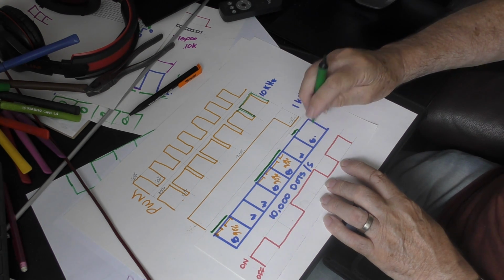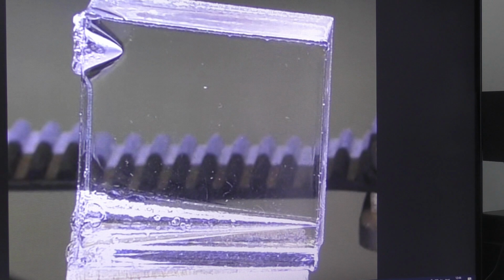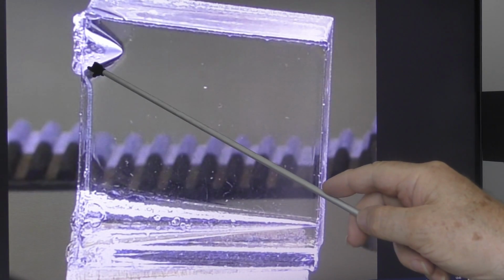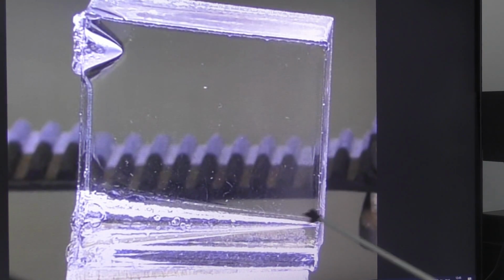Perhaps I ought to explain that, because there's another rather strange peculiarity about an RF laser. Now this is a picture of a glass tube mode burn. Here we've got full power for 10 seconds. And you can see that we've got a lovely Gaussian distribution here where the power at the center is doing the most damage. And after 10 seconds, this is what we produce. Now, when we change the power on a glass tube machine, we no longer get a sharp beam. This is 15% power. And look, the beam has now turned into a blunt beam. It's no longer this sharp beam.